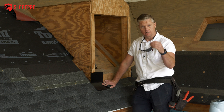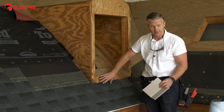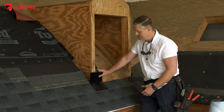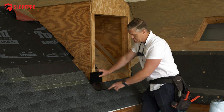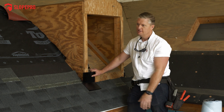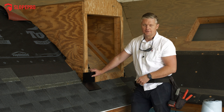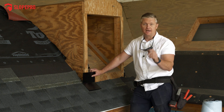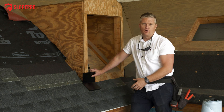One of the worst leaks you can have is a slow-progressing leak that is over top of structural framing. Anytime you have this wall right here, there are structural framing components in this transition. If you're getting a little bit of water in those nails for every rain from the first rain after the roof is installed, it might be 10 years before you realize you have a problem. But once you realize it, that's been leaking every single rain for 10 years - what you have is a rotted-out wall. I tell people all the time: if you're going to have a roof leak, you'd rather have a big leak that the first rain puts a big spot on your ceiling, leaks right in your house. Small leaks - nails in the wrong place in the flashing or between a shingle and the metal - those are the worst leaks, even though they're very small. They go on for years before you know they're a problem, and by the time you see it in your living room or kitchen, there's major framing damage.